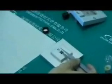We pick up the BGA using a pencil and place it on top of a high temp cloth provided. And we will put it to the hot plate. The hot plate temperature is normally preset at 230 degrees Celsius. Put the BGA on top of the heating plate with the high temp cloth until we see the solder melt.